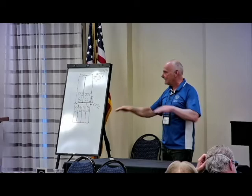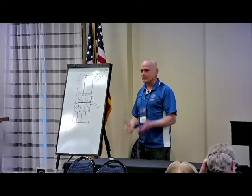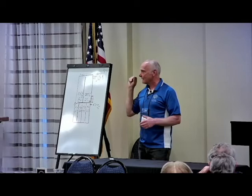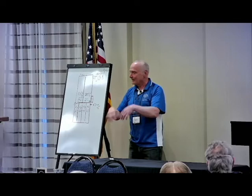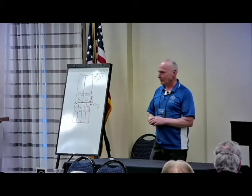When you put wood into an evaporator, that wood is cold, isn't it? And there's always moisture in it. It takes a lot of heat from the fire to bring that wood up to combustion temperature. Then, you can't see this happening, maybe, but what's happening really is that wood starts to turn from a solid into a gas. And it's the gas that burns. If you watch a campfire, you can see this very thing happen. You'll see smoke come out of a chunk of wood, and then that smoke catches a flame, and it starts to have a visible fire. So we want that to happen all the time. So steady heat input, really, really important. The better the wood quality, the easier this is.